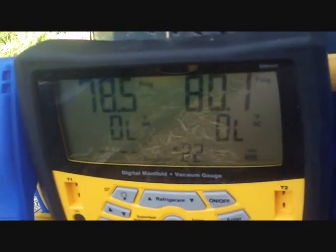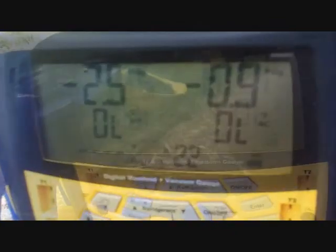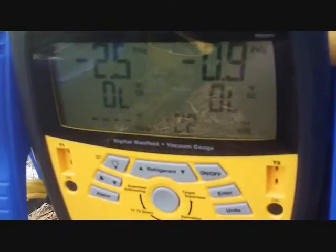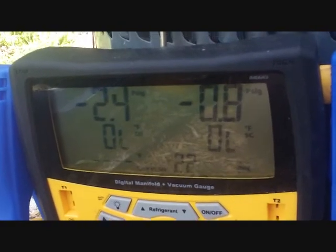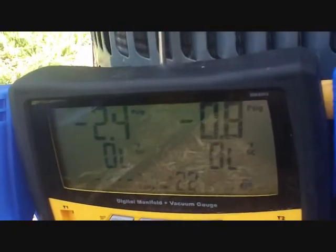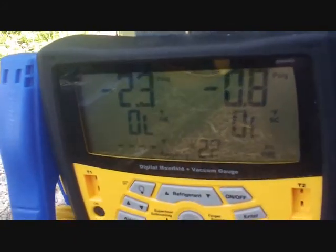And we'll go ahead and pump that down, and then we'll get ready to make our repair. Alright, we pulled the system down. It's actually in a slight vacuum. Make sure to turn the power off after you do this, so no happy homeowner comes to turn his AC on while you're working on it and gets a little surprise.